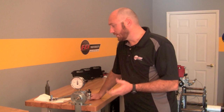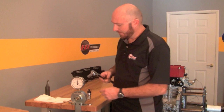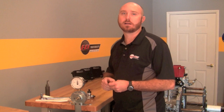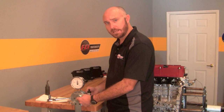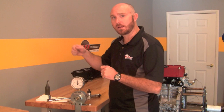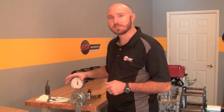What does that mean for you? It means that when assembling your engine — take rod bolts for example — you have no reliable way to know what the actual clamping force is if you rely only on torque. If all the bolts aren't equally clean, the threads aren't mated the same way, or you used more lubricant on one than another, you'll get a different amount of clamping force on every fastener. That's why with rod bolts specifically we want to know how much we've stretched the bolt to achieve the desired force. Let's say we've calculated we need 5,000 pounds of clamp force: we'd find a torque setting with the lubricant we intend to use that gives us 5,000 pounds, then measure the bolt length while under tension, remove it and measure it at rest — the difference will be a few thousandths of an inch. That stretch value is what we use when torquing the bolts into our engine, because that amount of stretch equals that amount of actual clamp force.